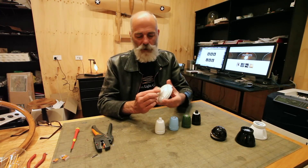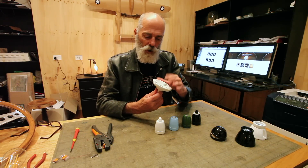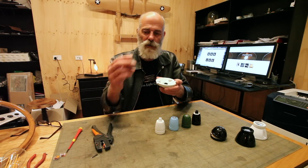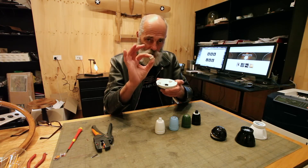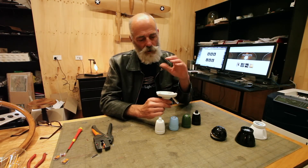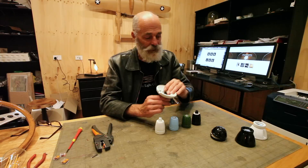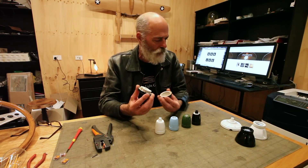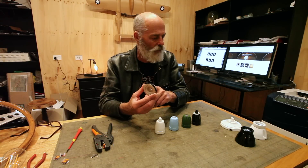This one has a cord grip to hold the cable. It doesn't have any integral wiring in the top, so your electrician will need to connect the mains separately via clips — we use WAGO clips, but anything will do. That connection may need to go into a junction box above the ceiling, but that's up to the installation and the electrician.